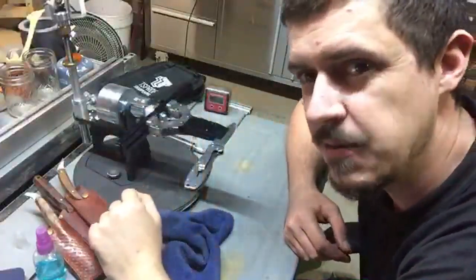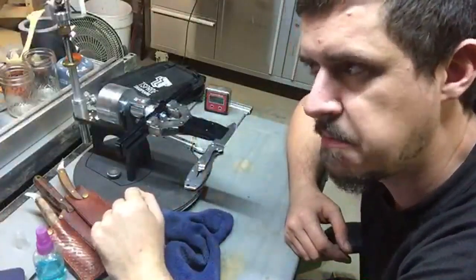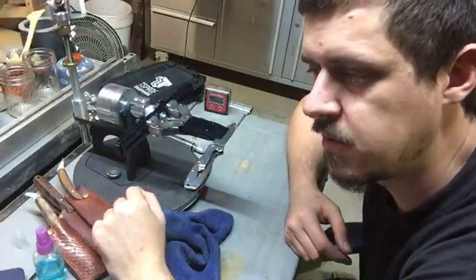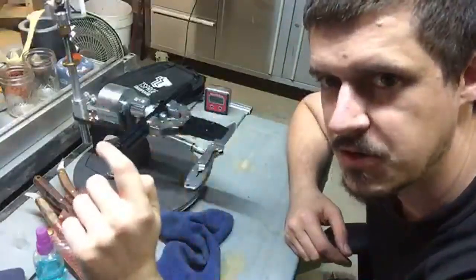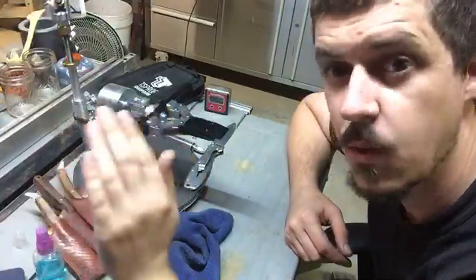Once you've gotten it apexed correctly, it's essentially polishing that blade down, because if you were to look at the edge under a microscope, it would actually look a lot like a mountain range at that point, because the sides of the steel are quite rough.